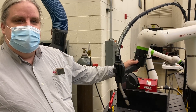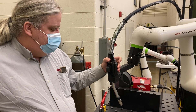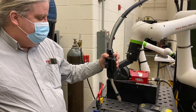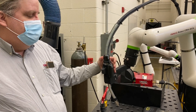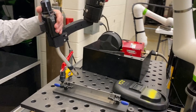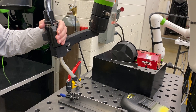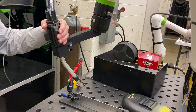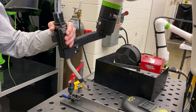Hitting this button changes jog modes. That one locks the tool center point into a fixed orientation, which is handy for welding. We can then rotate around the tool center point to set the perfect torch angle. Our fourth mode is a custom one that defaults to allowing some rotation around Z2 as well as translation.